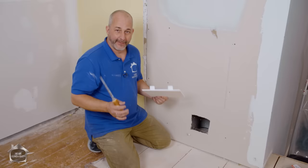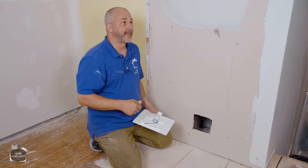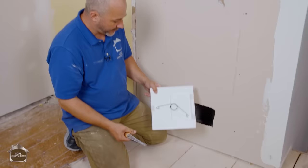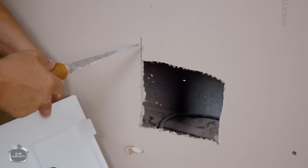The second situation I see a lot of people commenting about is they need to check and do an inspection on their valve, or change the valve from the backside. If you want to do an inspection anywhere in your house — let's say there are shark bite valves that might be dripping — you can buy one of these spring-loaded trapdoors. The hole in the wall needs to be as big as this framework plus some distance for compression. This is an 8x8, but I'll try to cut the hole so it's about that size, nice and square. You can use a drywall saw and cut the hole bigger than you need — it only costs six bucks.